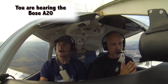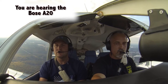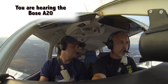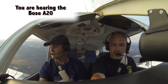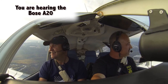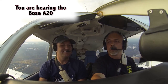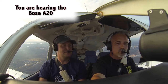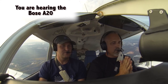For those not familiar with general aviation, the radio or head unit has an adjustable sensitivity. So if you listen, as soon as I quit talking it gets quiet. If I adjust it, it stays on all the time — you might actually be able to hear a little whoop whoop whoop. That is our beacon in the back of the airplane. That's just due to an older airplane — degraded technology. I'm sure this radio has a lot to do with it. It might be a grounding issue somewhere.